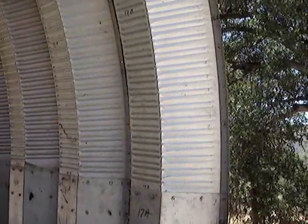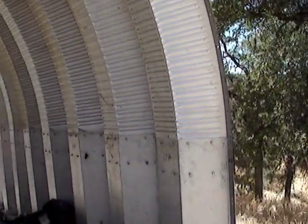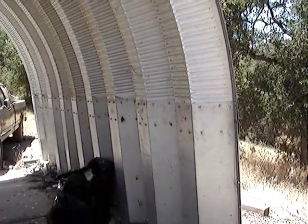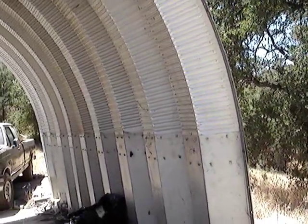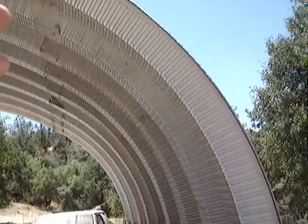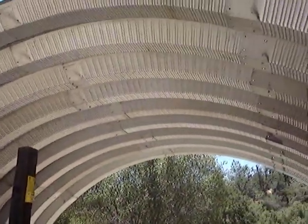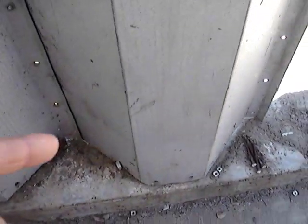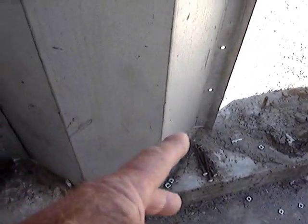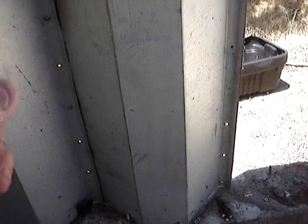If you buy one of these in a kit, the manual shows you to complete a full arch and then hoist it up — and I'm telling you, it won't work. The only way we could do it was to put a big X in here with two-by-fours. But you're adding as much in wood as the whole arch weighs — 200 pounds for an arch, plus 25 feet of wood going across to make an X to keep it rigid. When you try to lift one of these, you're rotating across a flat base all the way to one of these edges. It doesn't work.